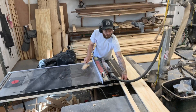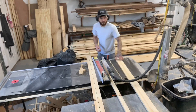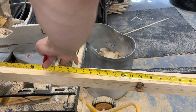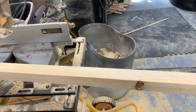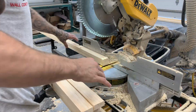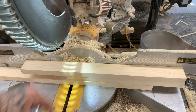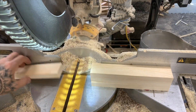So now we're going to go ahead and cut five strips at an inch and five eighths — this would be plenty to make the sides and the top. We're going to start out with the long pieces and cut 16 pieces at 22 inches. You will have a few extra, just accounting for knots or anything like that. Now let's move on to the side small pieces — we're going to cut 12 at nine and a half. Again, you will have a few extra, but we'll end up using some of these for support as well.